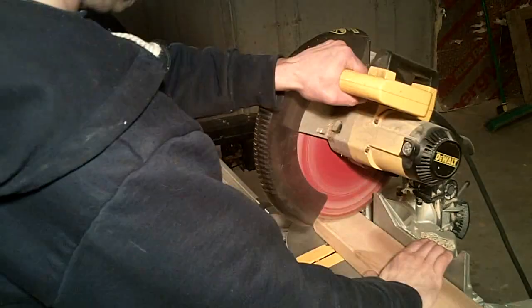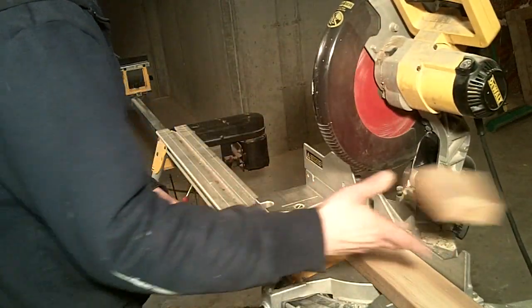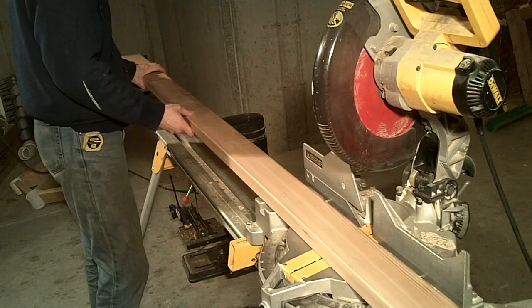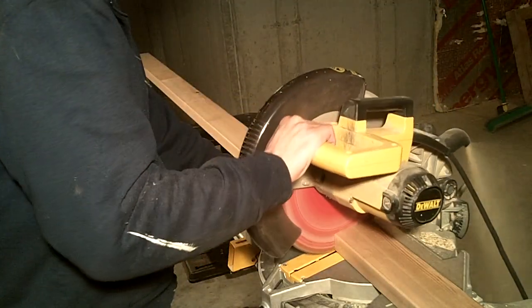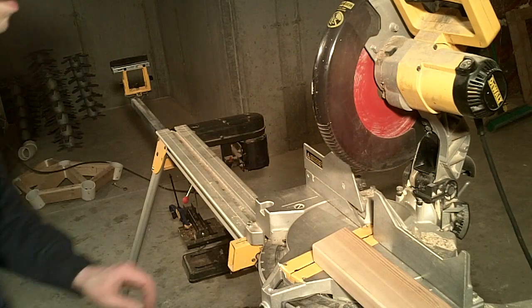The struts are made from red cedar 2x4s by 14 feet. This will be enough material to cut 2 struts from each board with some scrap. The end of each board is cut at a 12-degree angle so it will align with the hub. Not every hub connection is exactly 12 degrees, but there is enough flex in the structure for the angles to average out properly.